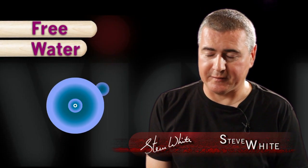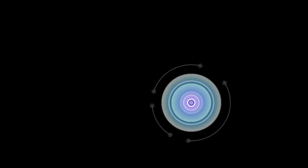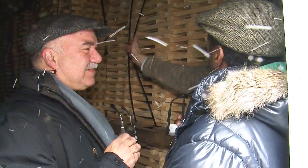The sticks are in the kiln somewhere between 10 and 12 days. The beginning of the kiln cycle gets rid of the free water, which reduces moisture content by about 25 percent. Then the bound water found within the cell walls begins to extract under the fiber saturation point, and the wood begins to shrink — you lose somewhere around 10 percent of the size of the stick. When the four-by-four-by-four-foot pallets enter the kiln they are tightly bound; upon exiting, the bands are loose due to the several inches of height loss during the process.